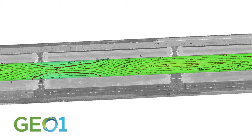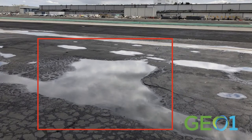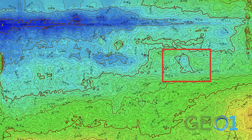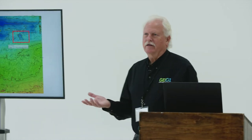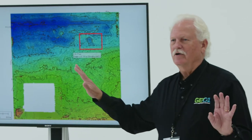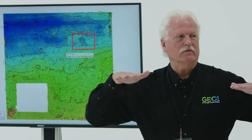How much dip does water need to collect? A quarter of an inch. This is our ramp after a rainstorm — I know water collects there, but let's quantify that and see what it looks like, where that water is coming from and where it's going. There's a sort of concrete spillway or drain represented here — you can see exactly where the water is going to flow. There's a tool called a watershed analysis, a water drop tool, a flood model, so you can take this, make it black and white, and incrementally raise the water level a centimeter at a time to see where that water is going to go next.